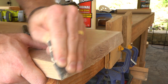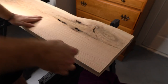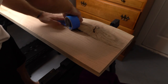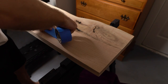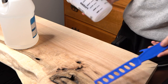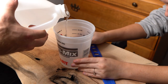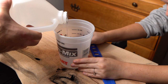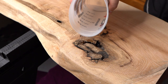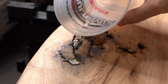Always make sure you keep some scrap pieces of the wood so you can test and play around with different ideas — that's what I was able to do during this process. Now that the hardest part is over, it's time to move on to the fun part. There were a lot of little holes from bugs that we wanted to fill with epoxy, and we still had a lot leftover from our last project. I went ahead and taped it down with painters tape and also Tyvek tape to help secure it. Make sure you put a flat surface underneath the live edge piece so the epoxy doesn't seep through the bottom — we didn't do that at first, but caught it in time. We used a clear epoxy with no color added, and filled all the little crevices and holes as best we could.